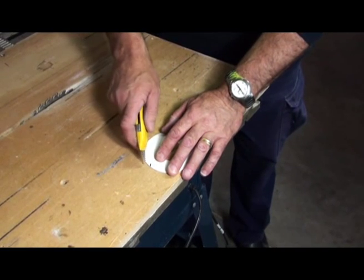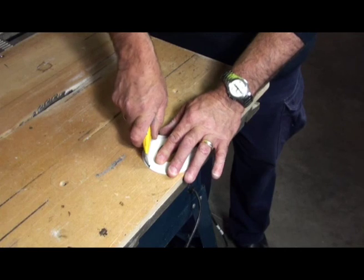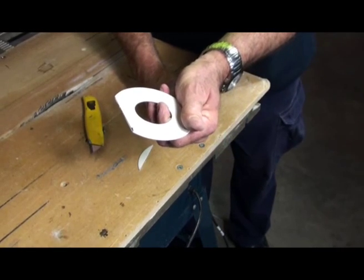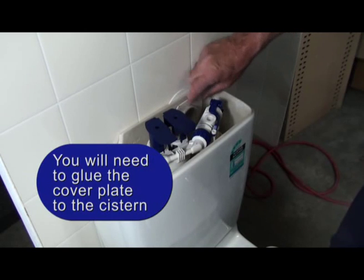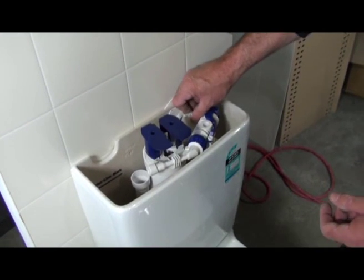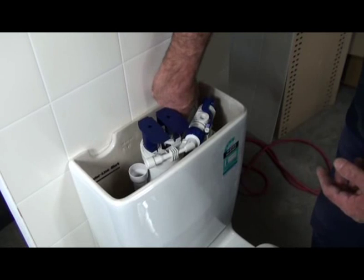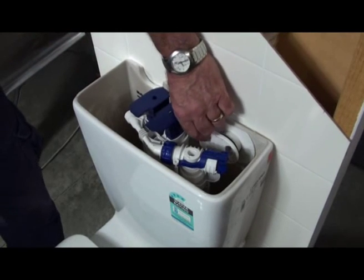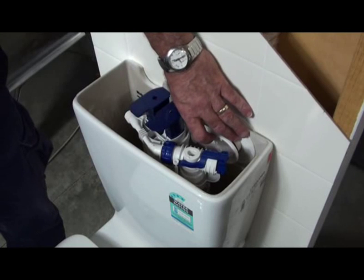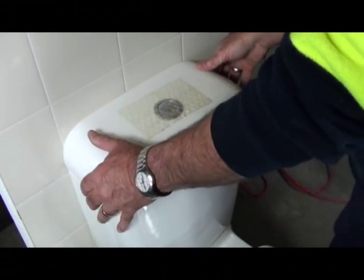With a sharp Stanley knife, going by the marking you've predetermined, just give it a nice heavy straight score across the lines, and then all you have to do is snap it off. That's how easy it is. Once we've cut the cover plate at our predetermined area, just insert it back onto the 40mm pipe. Then we put in the balancing valve, which just inserts straight into the 40mm pipe. It doesn't matter if you have it up or down — the balancing valve is fully adjustable. The best position is fully open, but if you want to reduce the amount of air being sucked through it, you just close it one or two notches. Then just insert the lid back on top of the system.